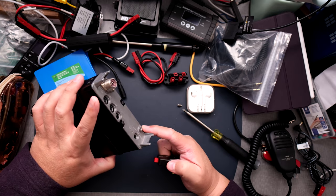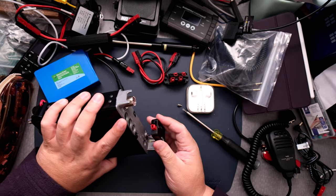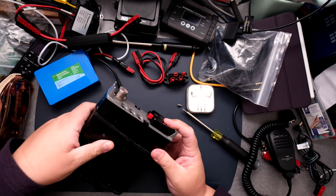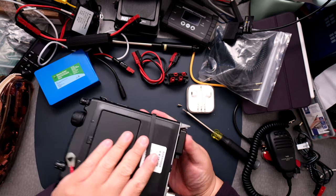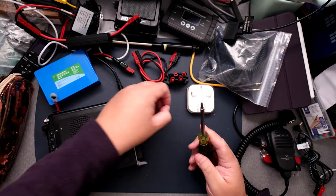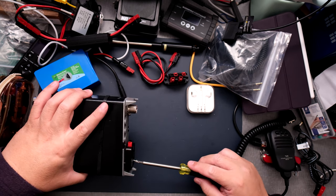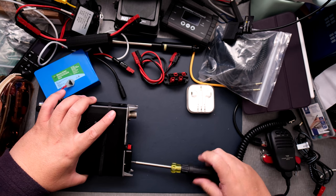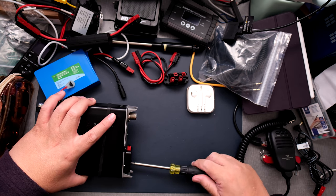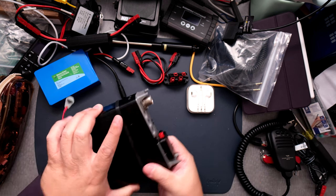So you've got to take out the screw that is for the ground. You can't use that same screw, by the way. And then you put this and orient it in the right way, making sure it's nice and firm, right? Then you take the screw that they give you, with the washer, and then you screw it in there. Do your best. Don't over-tighten, okay? Now it's solid.